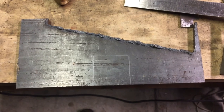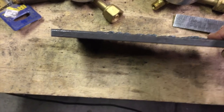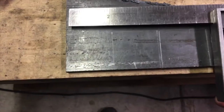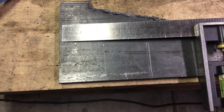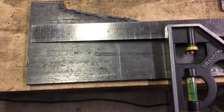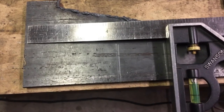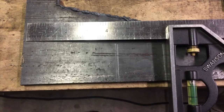I've laid out a piece of scrap — I believe this is probably at least three-eighths scrap — and I'm going to just lay it out here. I've marked it already; I've squared it all up and marked out three sections. I'm going to need two for one particular piece of equipment to attach chains to, and the other one I'm going to make something that slides up on one of my forks when I put my forks on my tractor. It's going to have a place to put a hook so that I can lift things with my forks. I can actually have a hook on the bottom whenever I need it.